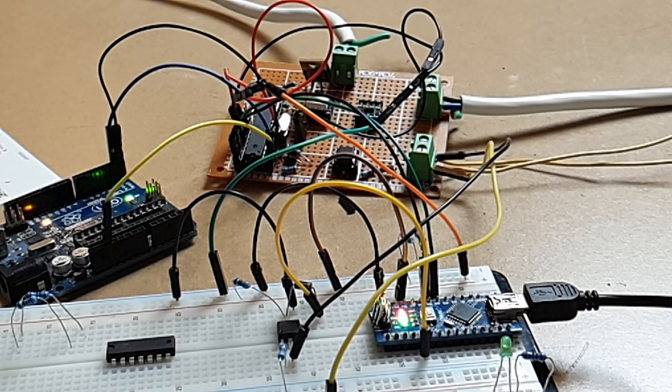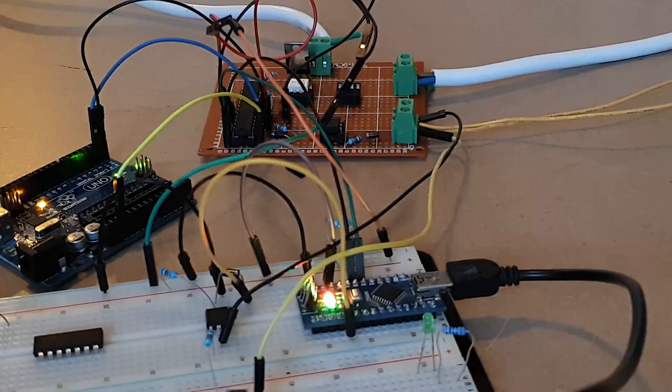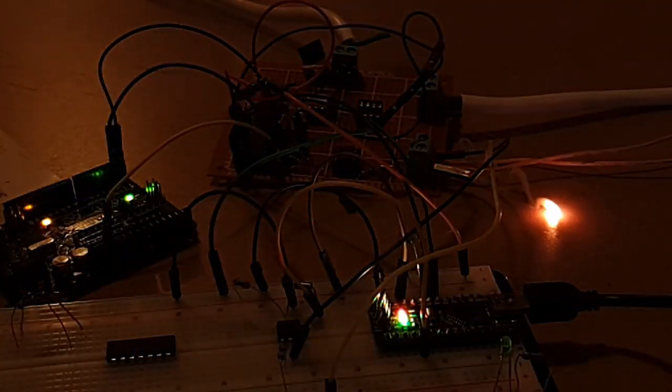I soldered in a new triac, set up the camera, and powered it up again. And again. Needless to say, I enjoyed watching it go bang. The triacs exploded. But why did it happen? I don't know actually why it happened. The first triacs I was using were the TIC206Ms, which according to the datasheet should have easily coped with the current and the high voltage.